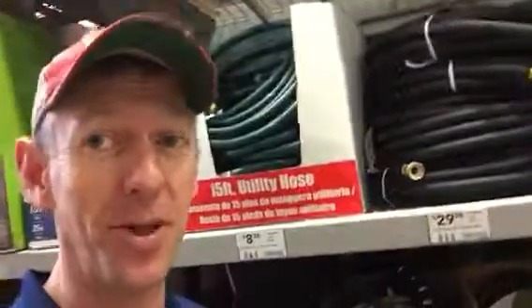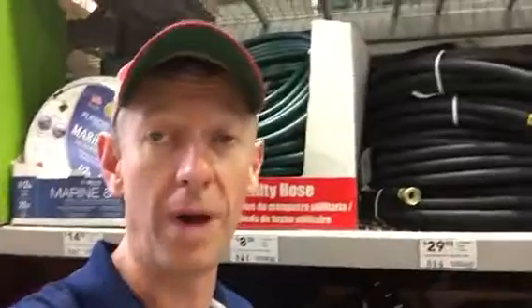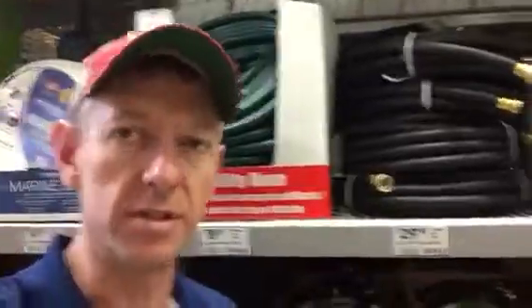I know we've had a lot of rain lately, so a lot of you probably aren't thinking about that. But whether you've had foundation repair done, still need to get it done, or maybe part of your house is fine — we really want to start using soaker hoses with these warm, hot, dry temperatures coming up. Looking at two to three times a week for about 45 minutes to get a nice consistent drop of water in the soil around your foundation and keep the moisture level consistent.